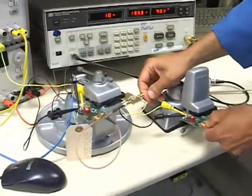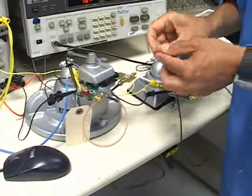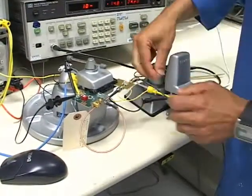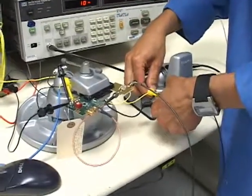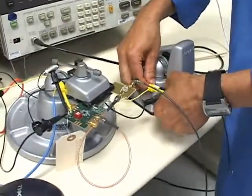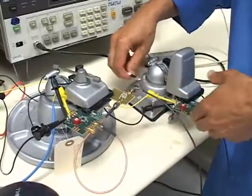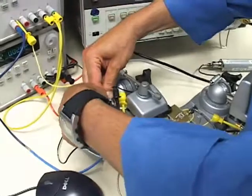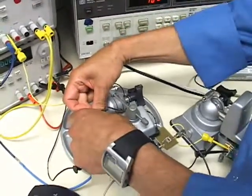As I explained earlier, we have the front end transformer which is an impedance ratio of 8, and the following stage — the LMH6629 in this case — is reduced in closed loop gain such that the overall insertion gain stays constant at 14 dB.